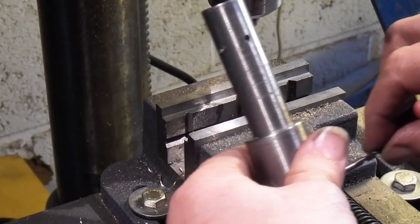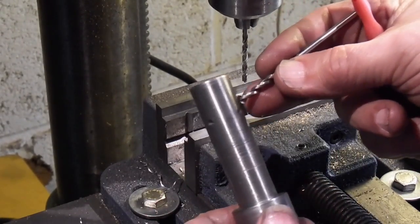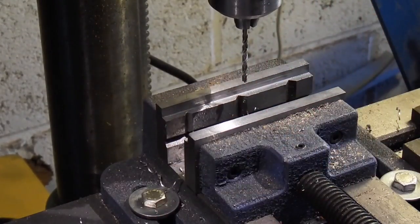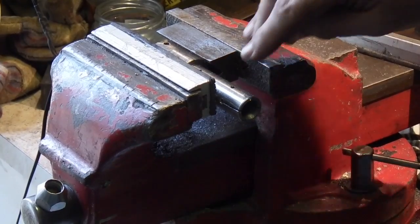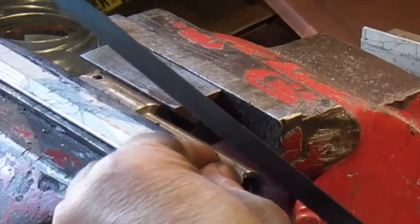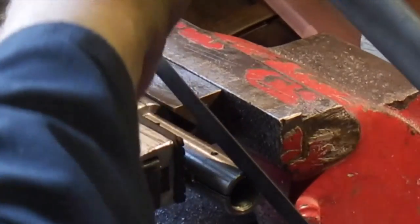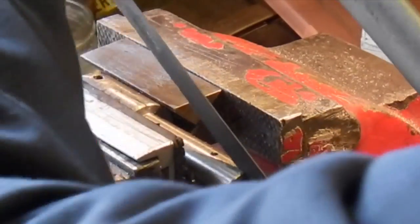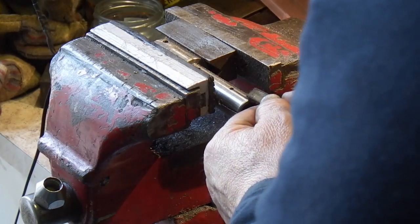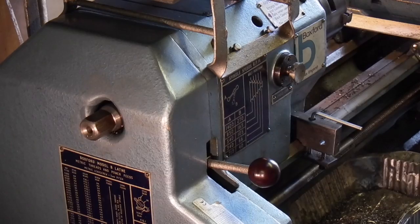I haven't got a slit saw narrow enough, but I think I could just put a saw cut straight down to each hole, and this is finished. So what I'm doing, I'm lining the hole up with the length of the body, marking the saw cut there, and just sawing down, filing off the rough edge. So the other 3 exactly the same way.